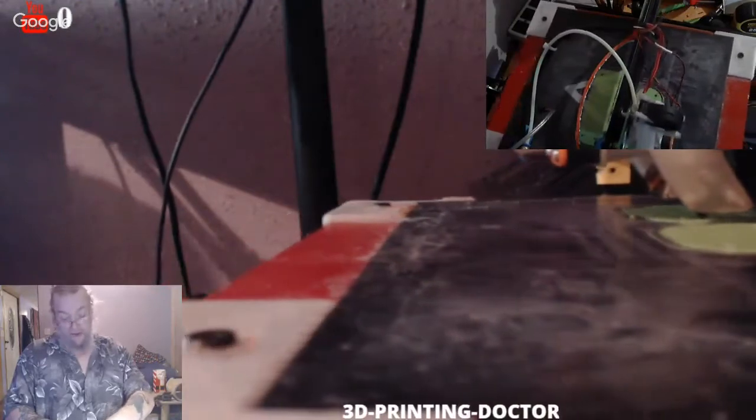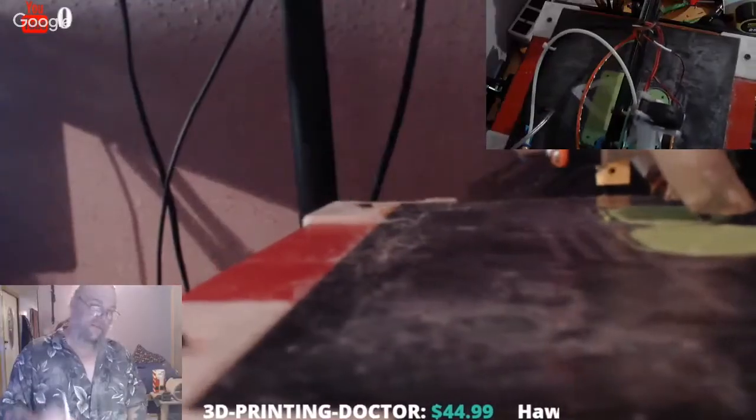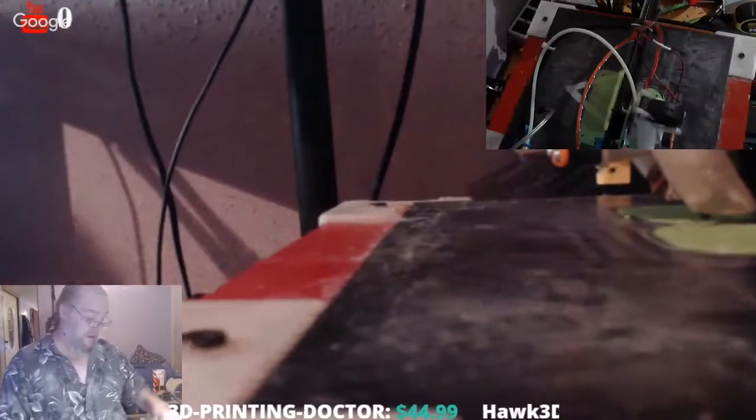Right now the easiest way to do it is with a blender. You know, a filament blender, the way Ben Craig does it, with the V slot that goes into one, or the diamond head. Those things aren't so reliable either, although that new G-Tech one looks really interesting to me. Because that's the first one that truly blends the filament. Almost all of them spit out a filament, and when it's done, it retracts it and spits out the other one. The G-Tech can feed 2 filaments at once and give you color mixing by slowing one down and speeding the other one up.